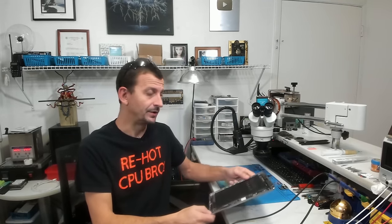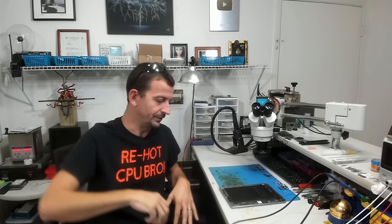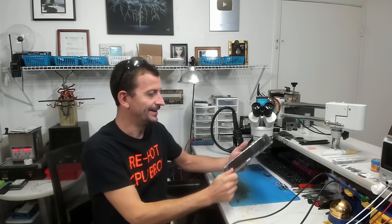So I have a little bit of a confession to make. This iPad came to me for repair last week, and without placing full blame on myself, this thing was a prior repair attempt. It had already had the TriStar removed. It had some components knocked around and missing. The dock flex had already been removed, and whenever it was shipped here, it was shipped in a container where the logic board was not held really firm, so it was allowed to slide around in the box, which allowed the dock flex to be torn off of the board, so there were a bunch of missing pads there.